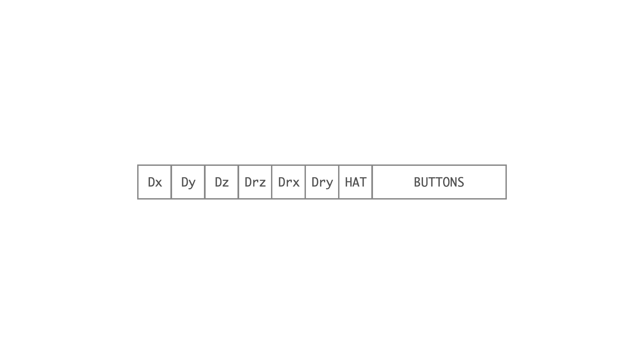Joystick reports are a little simpler. TinyUSB uses 11-byte reports for the gamepads, and the first six bytes are just deltas for the analog controls, which we just report as zero. The next byte is an event code for the hat switch, or d-pad, and that's how we report the joystick directional data. And then finally there is a 32-bit button mask field, and we report the joystick fire button as button A or button zero.